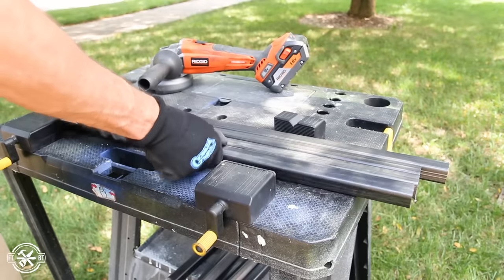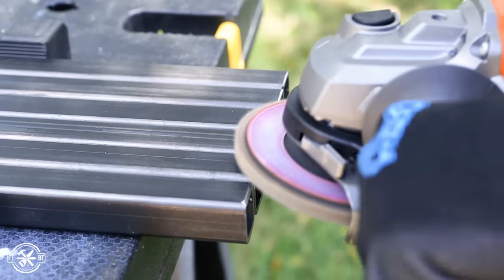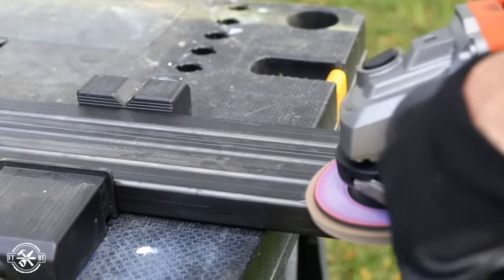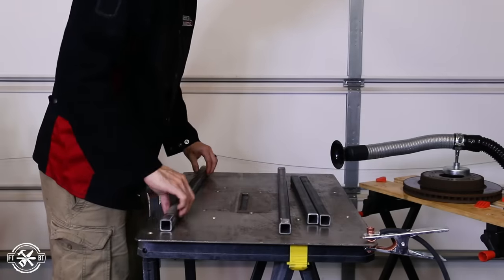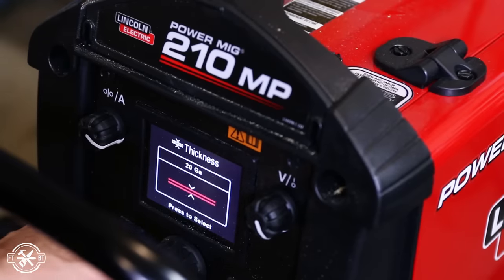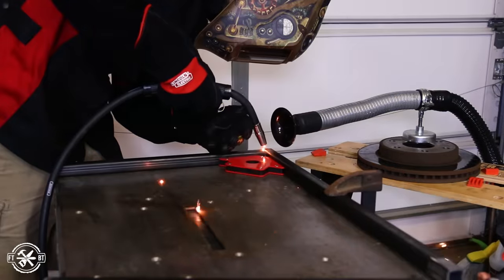While waiting on the top to dry, I moved over to make the base. I'm using one-inch tube steel and I had my local metal yard cut it to exact size for me, which was a huge time saver. I marked the joint connections and used a flap disc on my grinder to prep the metal for welding. My welder is the 210MP from Lincoln Electric — it sets the wire feed and voltage for me based on just a few inputs, which takes the guesswork out of welding. As a beginner I really appreciate that. You can find out more about the 210MP via the link in the description.